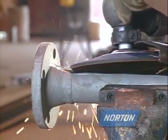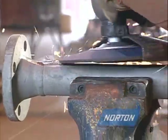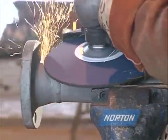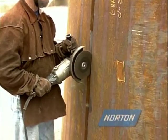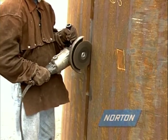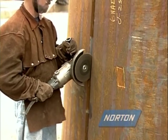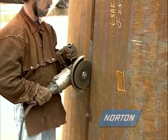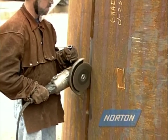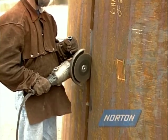Type 28 wheels have saucer-shaped grinding rims and are designed for applications where a very shallow angle is required or for side grinding. The type 28 wheel should never be used for cut-off or notching operations. In this application, an eighth-inch thick type 27 grinding wheel is being used. The outer periphery of the grinding wheel is doing the work. This wheel is designed for getting into tight places. Care must always be taken to avoid excessive side pressure or jamming the wheel, as excessive side pressure can cause this thinner type 27 wheel to break.